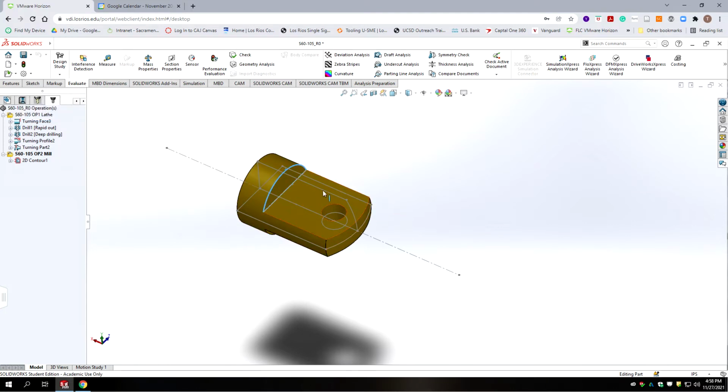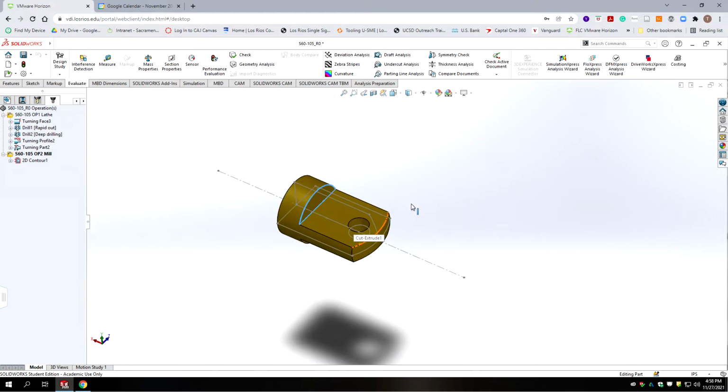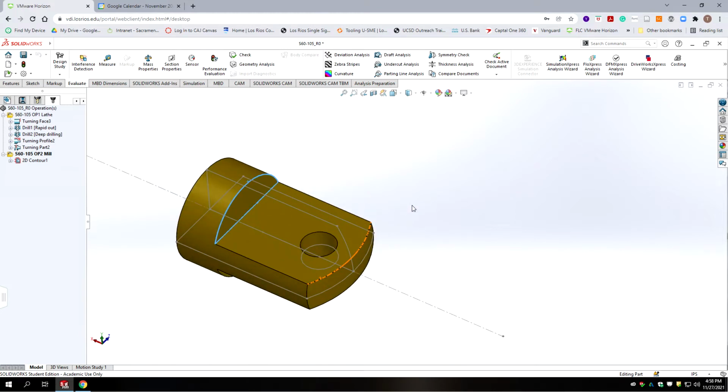Now, on the top, it's relatively straightforward. We cut this at line, we can do a couple steps. On the opposite side, typically you're going to want to cut actually in reverse. You're going to do a rough cut and you do a final finish cut that's going to be higher. There's not really a good way to program that. So what we're going to do is take an adjusted version of our cut on the top piece and do a translate down in Z. What does that mean? Here we go.